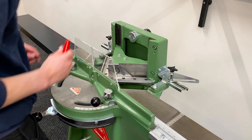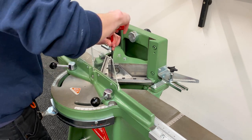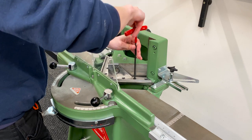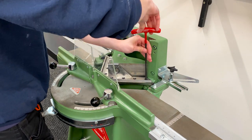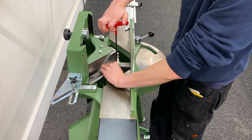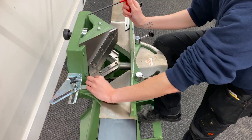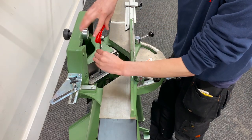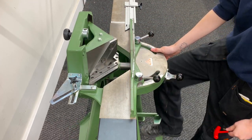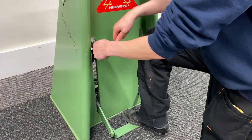Move the bottom knives back into place next to the blades and tighten the hex bolts. Carefully move the blade up and down to make sure there's no rubbing or scraping. Lock the pedal down again before reattaching the rebate support and guard.